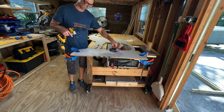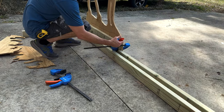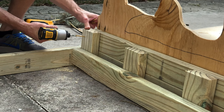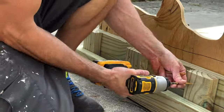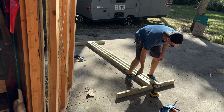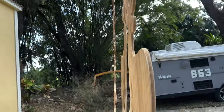I'm using wood glue to hold the main bracket on because I want to get a lot of years out of these things. I'm using 1-inch drywall screws mainly as a clamp to hold the wood until the glue dries, because eventually they are going to rust. The wood glue I'm using is Titebond 3 — it's waterproof, so we'll see how it holds up. I'm using 2.5-inch deck screws to hold the slot 2x4s to the main bracket. The 1.5-inch gap for the plywood actually helps give it more support and keeps it standing upright so it doesn't lean.